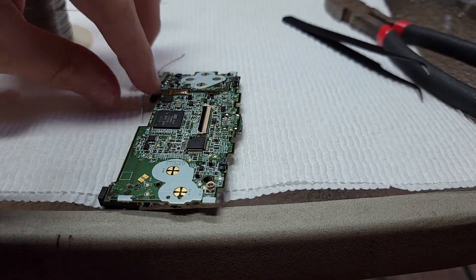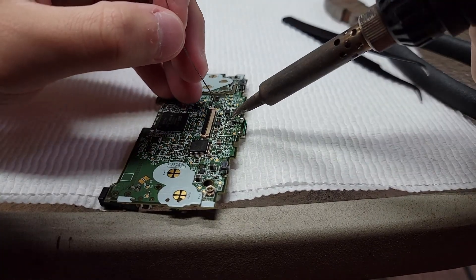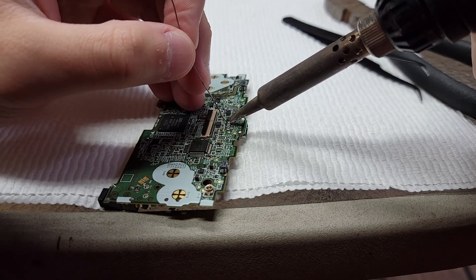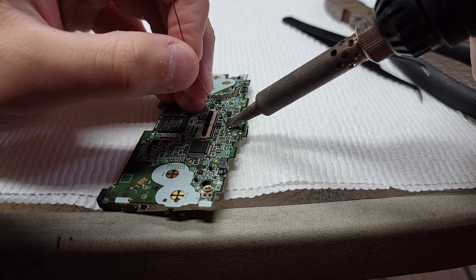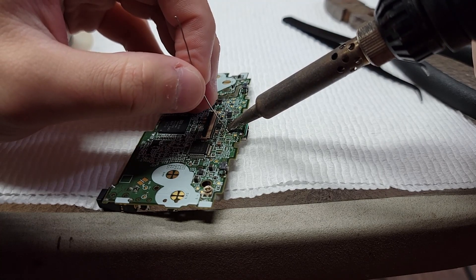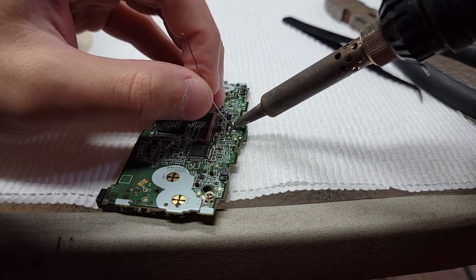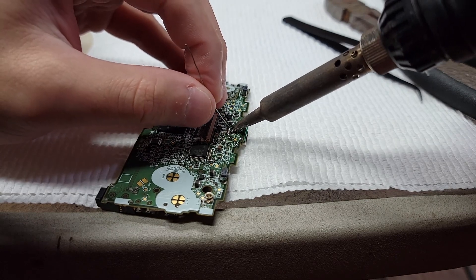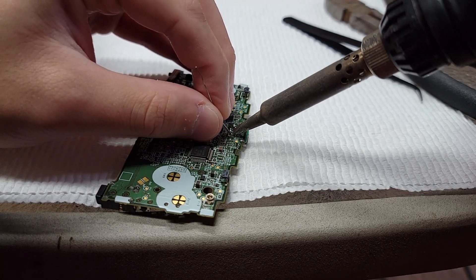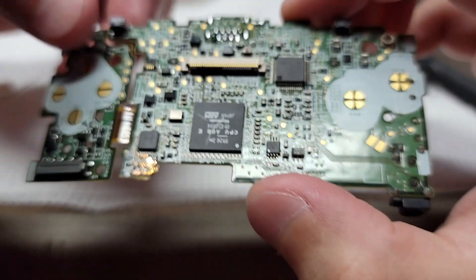When you solder these pins, you want to start with the pins that are closest to that ribbon latch, because the front pins get in the way. If you were to solder the front pins first and then try to do the back pins, you will be mixing solder together and the pins will bridge. Remember not to add an insane amount of solder here — if you add way too much, the solder could bridge underneath the motherboard. And taking off the adapter without a hot air station is relatively impossible to do.